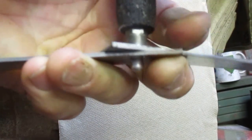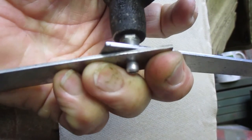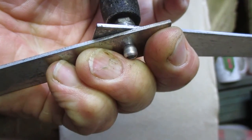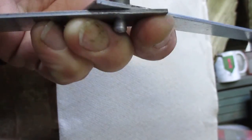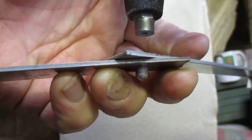And then if we can see underneath between my fingers there, you can see how the body of the rivet is being distorted by the button on the mandrel. Now this third and last squeeze, you're going to hear a click, and that's the mandrel breaking off.